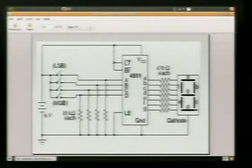We've got some resistors going on down here. These are what we call pull-up resistors. When I talked earlier about the undefined zone, it's possible in your projects, with all the stuff you've got going on, that you might get a little noise in your system. It could make it look like there's a signal coming through on your line. However your stuff's wired up, it could look like it's more than 0.8 of a volt when you're not really pushing the button. So you might get a weird flicker in your light, or weird errors, or your signal looks flaky. By using these resistors, it makes sure that no signal is getting through unless it's driven by the source. So it's going to take a substantial amount of voltage, not just phantom voltage going on there.